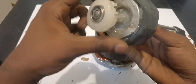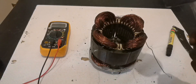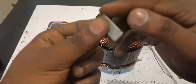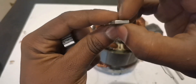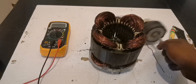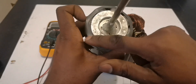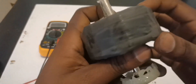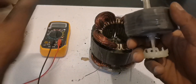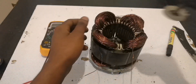Now let's go to the magnet section using this rotor — it's from another motor. I used the small one so we can have space on the sides. I'm using these neodymium magnets: 30 millimeters long, 10 millimeters wide, and 3mm thick. I made eight poles — one, two, three, four, five, six, seven, eight — north, south, north, south alternating. Then I covered them with insulation tape to hold them together and avoid them coming out, since I'm using glue stick.